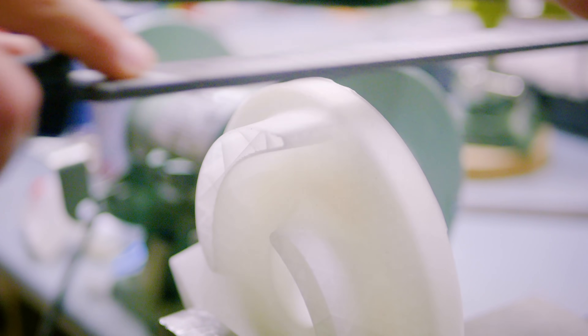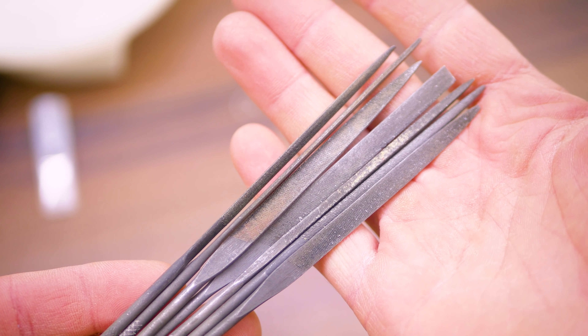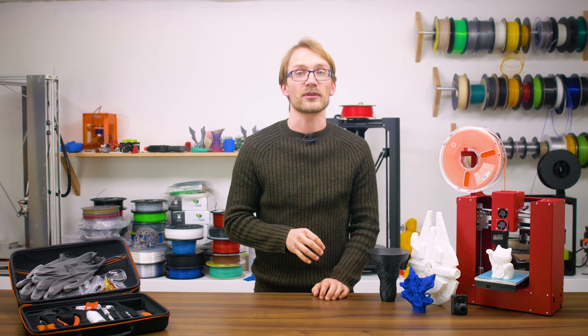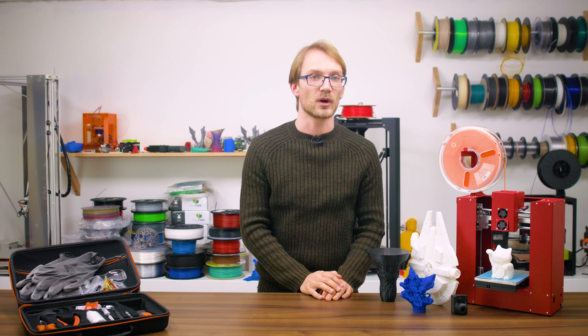For those, I simply grab a file and give them a quick pass. Pro tip: these small needle files always come in handy for finer details and aren't even that expensive — links in the video description. When using files on PLA, always go a bit slower than you think, since PLA will easily turn into a gooey mess if you get it too hot.